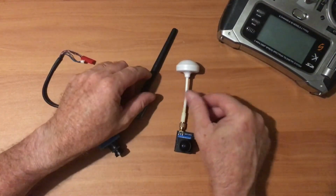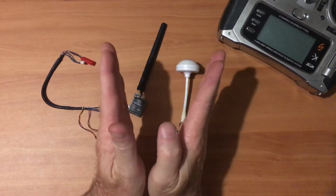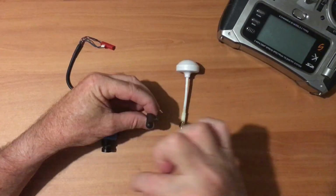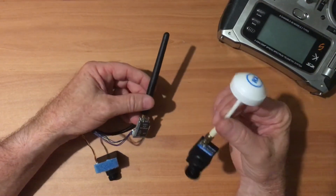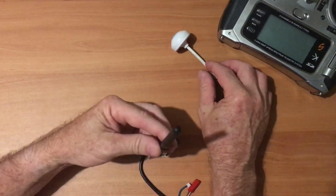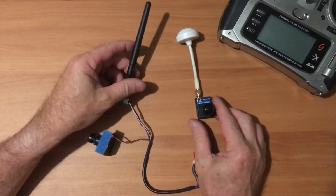So if you're flying at long distances, you'll have some kind of patch antenna or dish antenna that can project its listening pattern out wide. Its gain is that way. Compared to an Omni, looking straight down on top, the gain is circular. You can fly around. Good for close in, probably all you need for the UAV challenge. Have that on your aircraft, a matching one of those on the ground. If you've got that on your aircraft, if that's all you can afford, have a matching dipole on the ground. Don't mix and match antennas like that. Antennas.